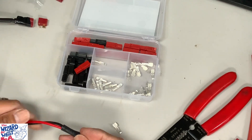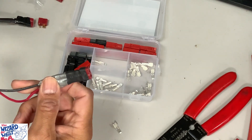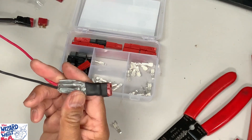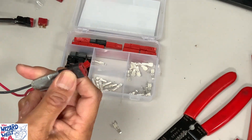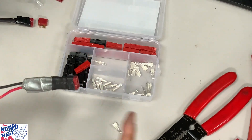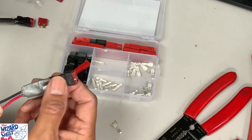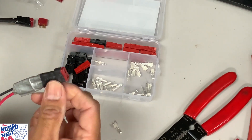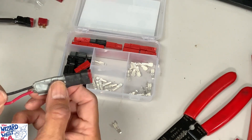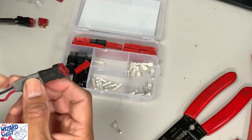Here we have an end. I'm going to remove this end. By the way, here's a good connection tip — what I like to do is shrink wrap them so you have a holder. When you shrink wrap Dean's connectors, put a shrink wrap on them so when you pull them it has some strength, because I've had a solder come loose. It's really nice to put a shrink wrap on these — that really helps a lot. That's one thing you should do with Dean's connectors.